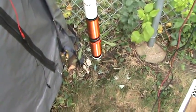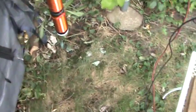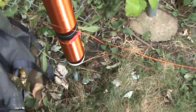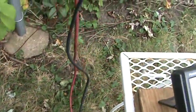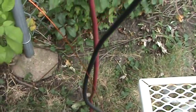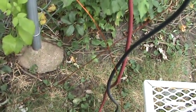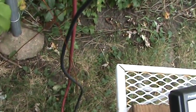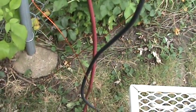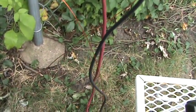I'm seeing that the top and bottom of the coil — the wires that come off, top and bottom — they're crossing right there. That's making a difference in the voltage too. I tried twisting them one whole twist; it does not work. Just that they're touching each other. Now this is an enamel coated wire, so it must be affecting it somehow with the magnetic field.